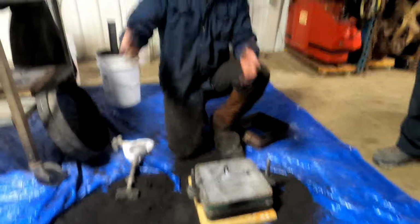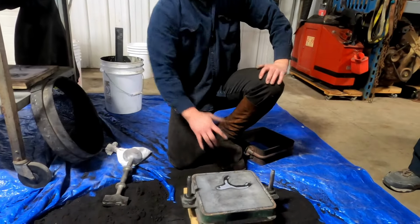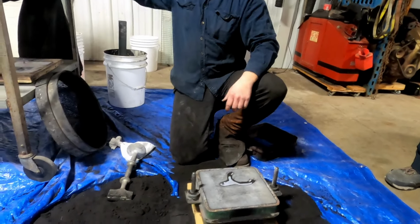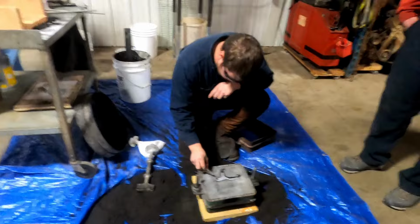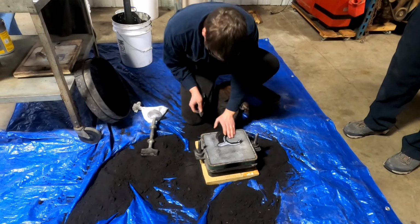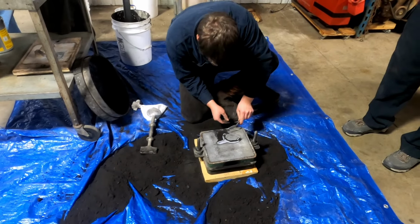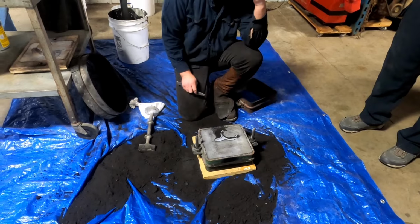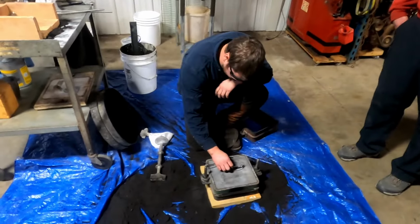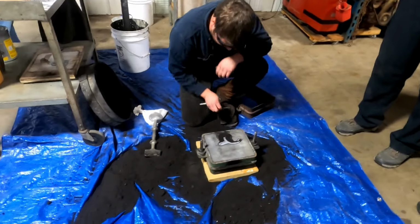And so this is why loose pattern molding is so much more difficult. It's cocked slightly, and because there's the little nubs that cross the parting line, I have to carve this all the way down to the parting line, all the way around. How do you know where the parting line is? You gotta memorize it before you put it in the sand. That's the number one issue people screw up on, is they don't know where their parting line is, and then they get tear up.